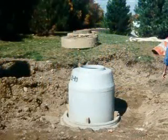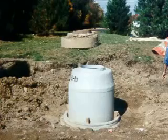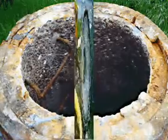We recommend using a fiberglass manhole liner which is six inches smaller in diameter than the existing structure. This type of manhole can be slip-lined with minimal excavation.